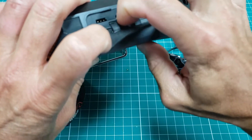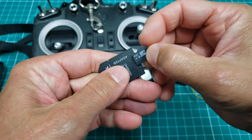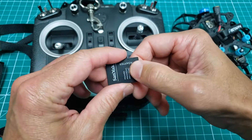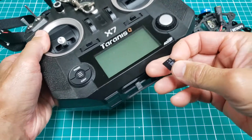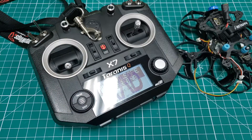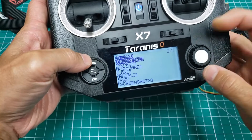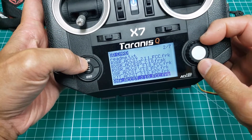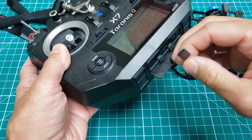I won't go into extensive detail of actually getting the firmware on your SD card — I've covered that before — but essentially you get the firmware from the FrSky site. I have this little SD card adapter; I'll plug it into my Mac, put the firmware into the firmware folder onto the micro SD, and then we'll load it onto the XM Plus. I've placed the firmware on the SD card. I'll make note that we want the FCC version since I'm in the U.S. I'll go ahead and power up, do a long press of the menu button, go to the next page, go to firmware. You can see all the different receiver firmware I've previously updated. We'll go with the 2.1.0 FCC for the XM Plus, then I'll make sure to connect this servo lead into the bottom here.